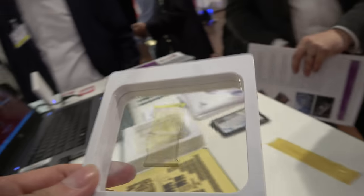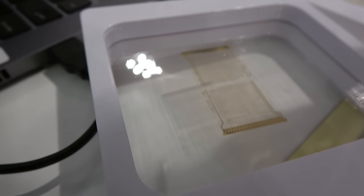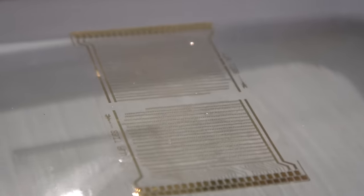If you look very closely inside, you see these individual small squares — each square is a thin film transistor. This is a circuit combining three to four thousand thin film transistors. It's a unipolar technology at low temperature on plastic foil, and this is a full microprocessor operation — a general purpose microprocessor. Of course, it's very slow compared to traditional silicon devices, but there are applications where these simple small circuits can be used.